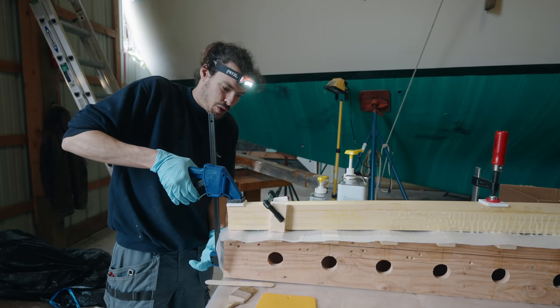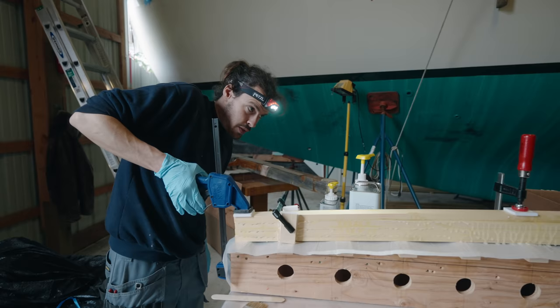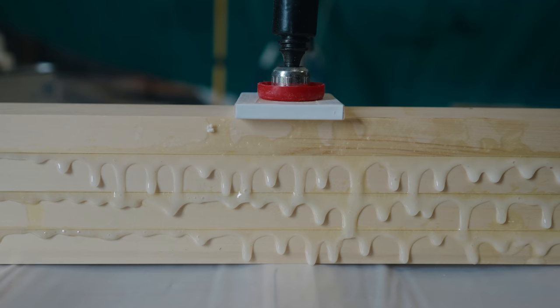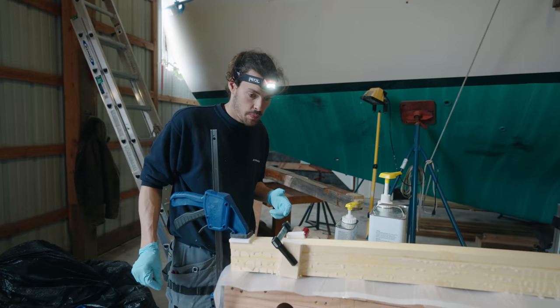And also, you don't want all of the epoxy to squeeze out of there, so don't, like, tighten them with two hands. I mean, there still is tons of squeeze out, and it seems like I'm tightening them a lot, but you do want some epoxy in there.